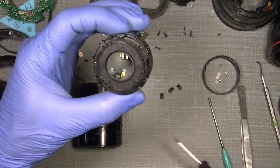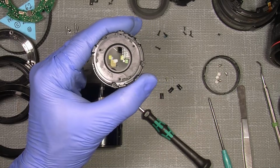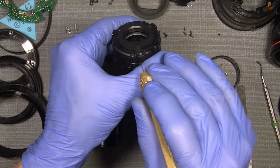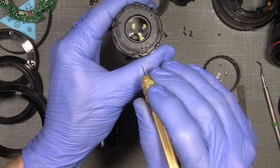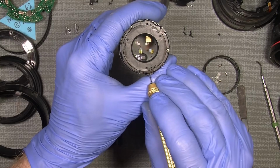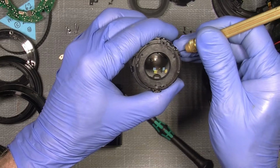And before I take it apart, I found out what I think is a good solution, because it works in my own lens. What I do is make a scratch here. Before I take out both eccentrics, I will also set a mark there, and also on the 3 screws sitting around here, there and there. So making a scratch here, I will know the exact position of that, as I understand.